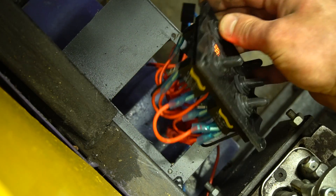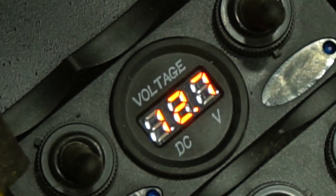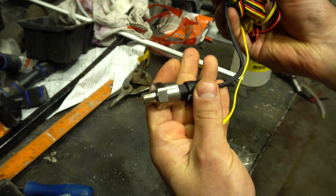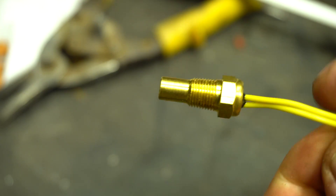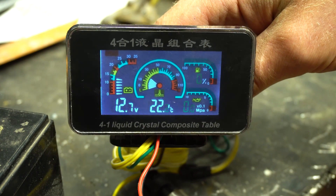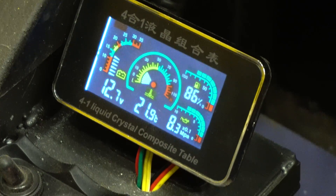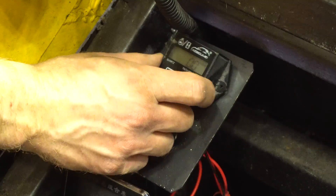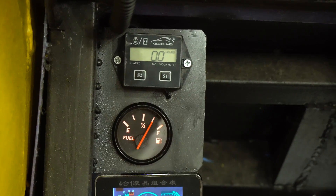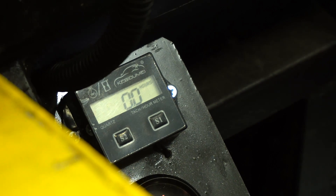I installed the toggle switches in their place and checked the voltmeter and the generator at the same time. I also acquired a device that shows the fuel level, temperature, and oil pressure. My goal is to monitor the oil temperature in the hydraulic tank, so I screwed a temperature sensor into it. The monitor was installed on the left side. I welded a separate plate with an angle bracket for the fuel level sensor and the motometer. It's rather convenient that the motometer also shows the engine speed.